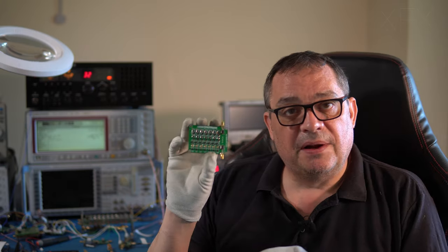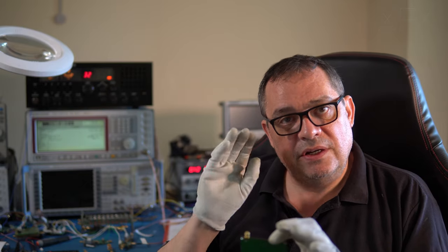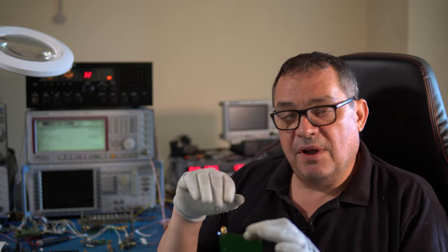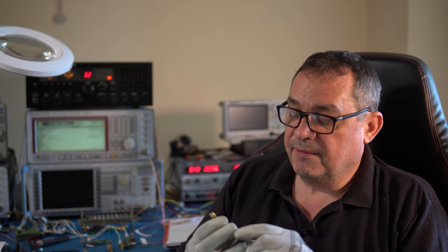I was a little skeptical about this, if I'm honest, because you've got to be careful how much information you let into the mixer. If you start putting too much information into the mixer, you have to start attenuating, because the intermodulation products will start to pick up, and in turn that makes noise and degrades the performance.